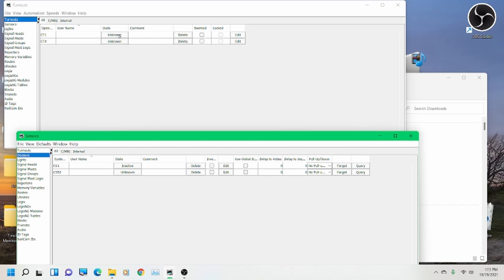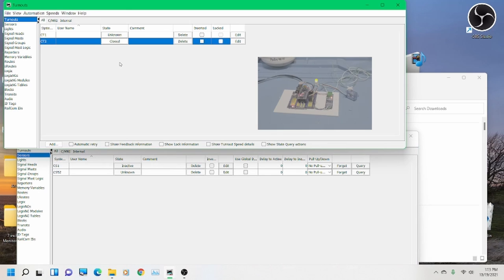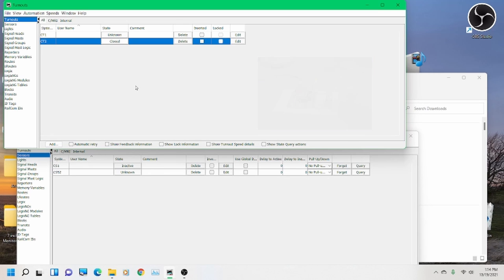So what you do is, if you simply just click on the servo, I've got this one hooked up to number 2. It'll go to the closed position, which is where it defaulted to. The next click, it will go to the thrown position. So you can watch the servo go, the light changes over, click back again, it goes to closed, the green light comes on, red light goes out. Quite simple, works very well, okay?